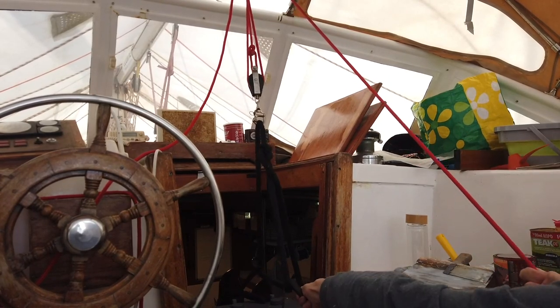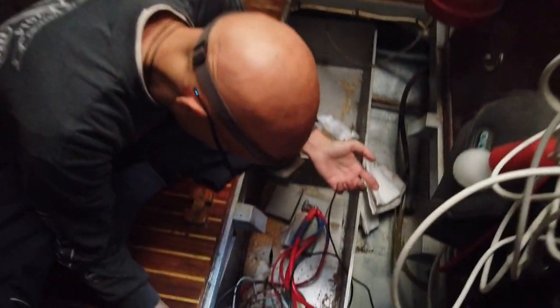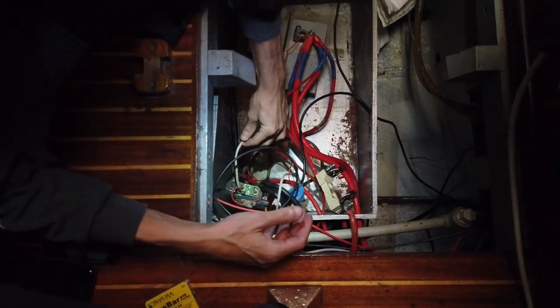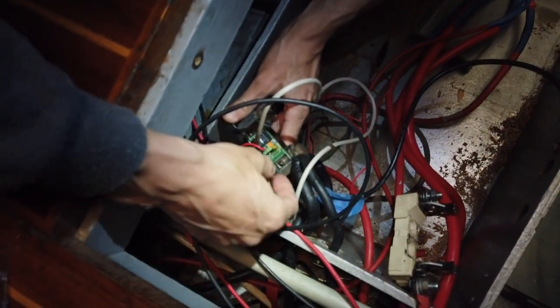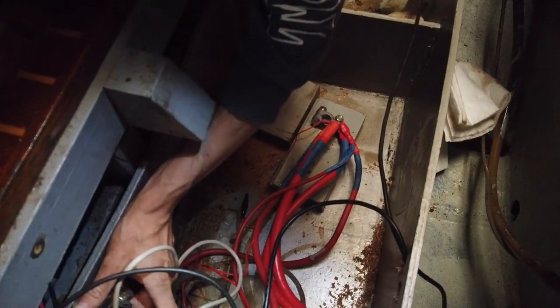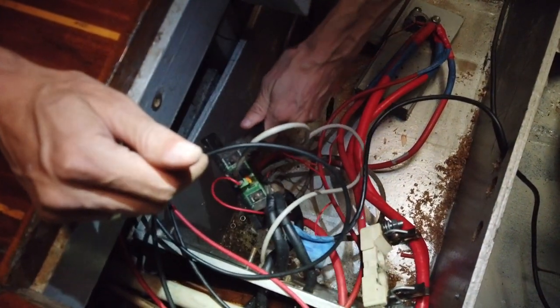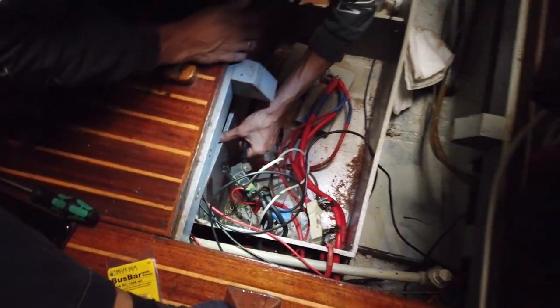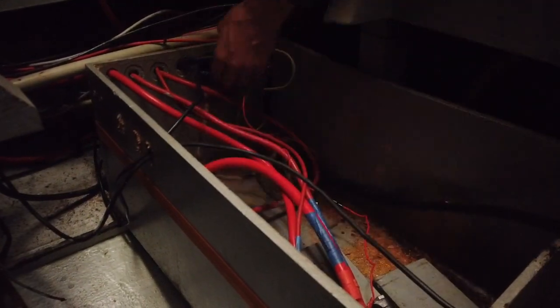How to make the best possible setup happen with the resources on hand and a somewhat limited amount of time. The new Hometronics battery would tie straight into the system needing no adjustments at all, so that was already a big relief. All the cables from the entire boat come together here — all the plus cables here, all the minuses here. This is our shunt for the Victron battery monitor, which has a small plus going straight to the battery to get its own power, telling us how much power we have at any given point. The trouble now is cleaning up this whole mess, mostly because all the cables go through this old wooden fiberglass box that we will get rid of.